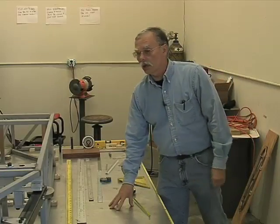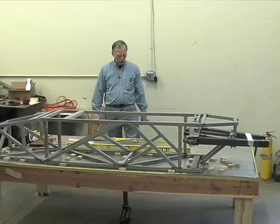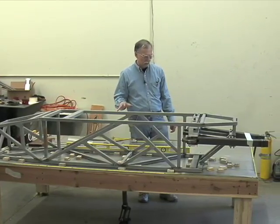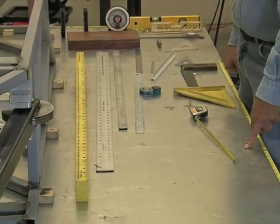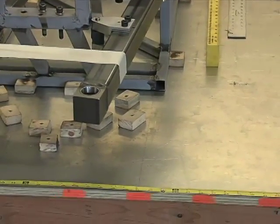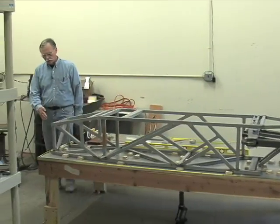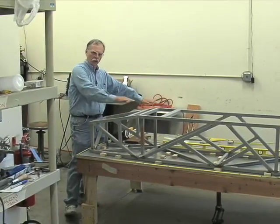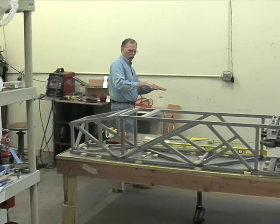So this is called a surface table, or a surface plate even. You can fabricate one of these for a fairly large project relatively inexpensively. This is a 4x8 sheet of aluminum. It's 1 millimeter thick. It's attached to a 1-inch thick piece of plywood. The plywood is mounted on a frame of 2x6s, mounted vertically, just like floor joists. That way we get a nice, stiff, level bed.